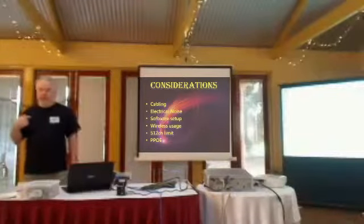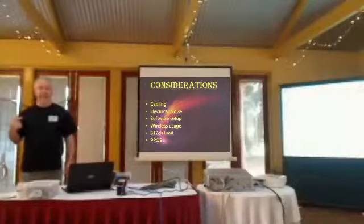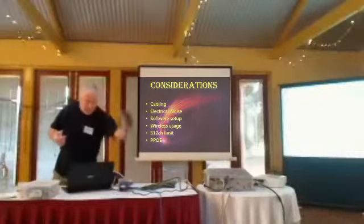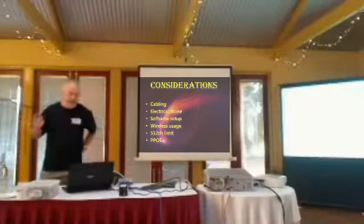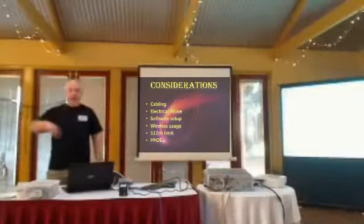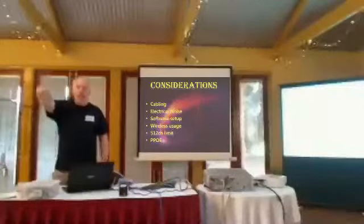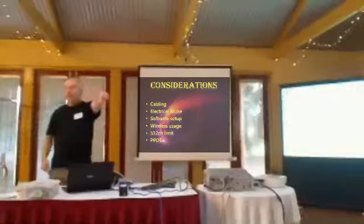Okay. So, quite a lot of things. I've seen some really weird, strange setups in terms of DMX that shouldn't work, but do. Okay? My own setup, even last year with all my pixel technology, I still ran these two. These two are actually my two DMX universes going out, in addition to my other 20 universes. One cable going out, and one cable running away out of the garage to a controller, about 8 to 9 metres, across 6 metres to another controller, another 6 metre jump. There was about a 12 metre run across the front yard, down to another controller, across to another controller, and that's where it terminated.